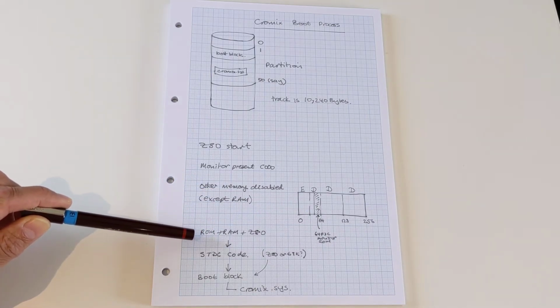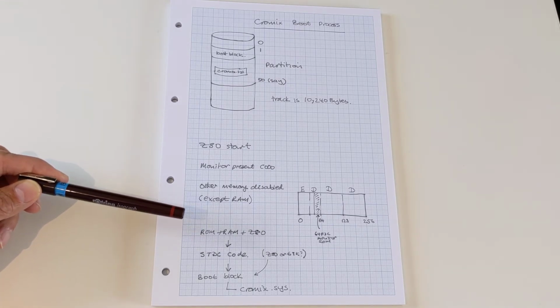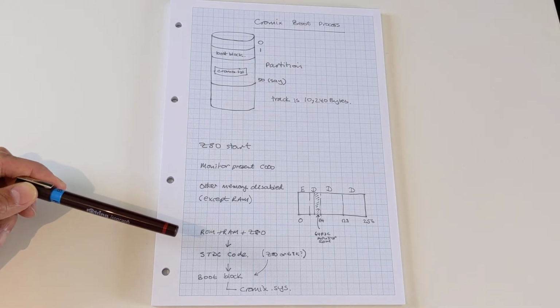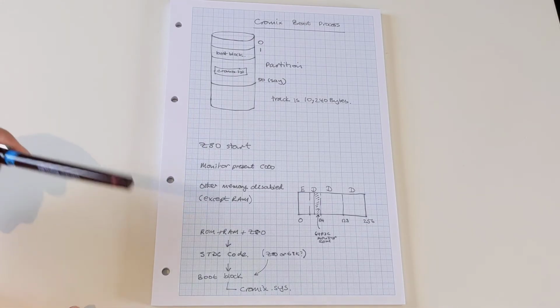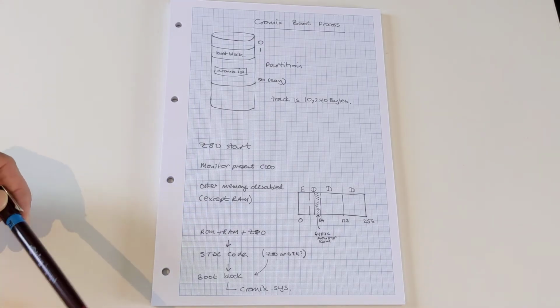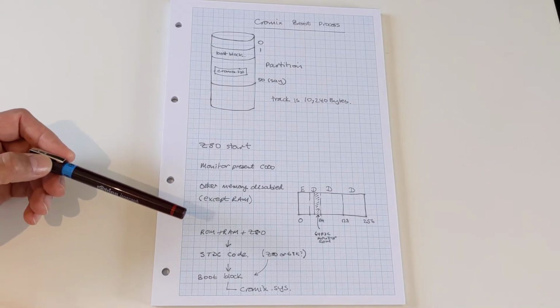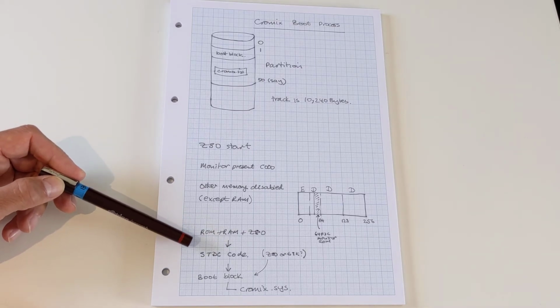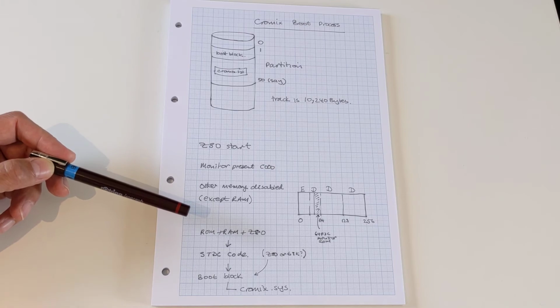So you'd hit enter a few times typically, and there's a serial port on the diskette controller, and the initial monitor code is just looking for your input on the serial port, and based on the fact that it expects you to hit the return key, it would figure out what your baud rate was. There were some options to set the baud rate to fixed, but there's a clever option which says automatically detect the baud rate. So the Z80 first of all determines your baud rate, and then prints a message on the screen saying Cromemco RDOS typically.